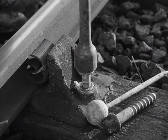Next, the fastenings on one side must be secured. On the other side, the rail is held into gauge with a bar while new fastening holes are made. Bob watches carefully to make sure the rail is held firmly against the gauge the whole time. With the chair screws replaced, the line will once more be true to gauge.